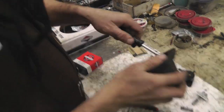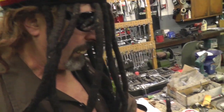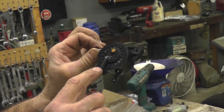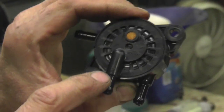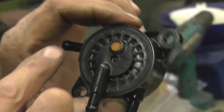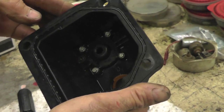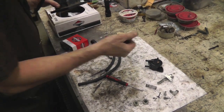Now you can do this anywhere you can pick up vacuum on a motor — you can use one of these vacuum operated pumps, and then you ain't got to go and get those electric fuel pumps and start hooking them up to stuff. Anywhere you can get vacuum. Now remember on the Briggs one, this is the pulse line, and then in and out. There's little marks on there — there's a little P, it says P for pulse, and there's a little arrow in and a little arrow out. So remember that when you're looking at these pumps. That's on there, screwed in. Now we're going to go put it back on there and hook up the fuel line — I already got two pieces cut ahead of time.